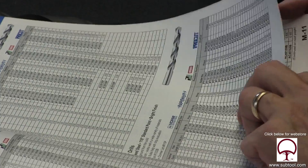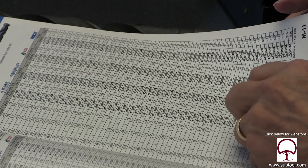If you go through the catalog, you'll find that there are different shapes of drills, different types as far as material. There's carbon drills, high speed with cobalt, TIN coated drills, tip coated, the whole drill is coated. You can get into different types of spiral drills, screw machine drills which are short, left hand drills — believe it or not — metric drills, taper drills with smaller shafts for use in a hand drill with a maximum chuck size but a larger drill diameter, with a turned-down shank.